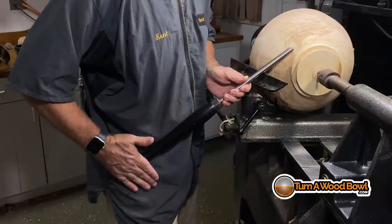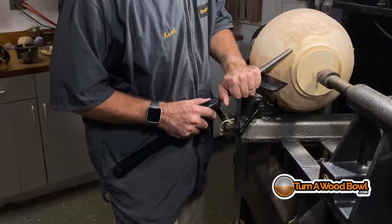When I was first introduced to this technique, I was not comfortable with it — it didn't come natural at first because it's kind of backwards to everything you've been doing with the bowl gouge. Just practice it a little bit and get familiar with it. Try it several different times, work small areas, keep your tool rest at about a 90-degree angle, and put down pressure on the tool into the tool rest so it's well supported, and have it supported up against your hip as you're turning. Go slow with it, make light shaves. When you start getting that really nice smooth dust — a little hair dust — then you're doing it right. This is a really great technique to have in your arsenal, and a great way to have a beautiful finish on your bowl without using sandpaper.